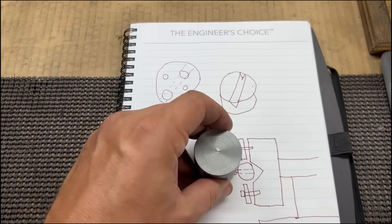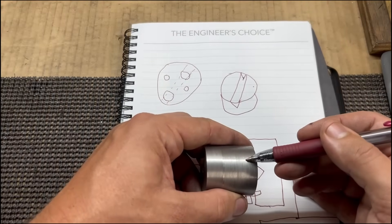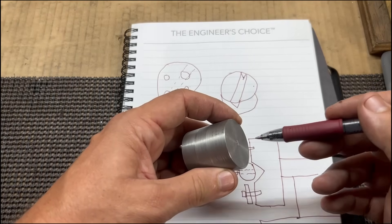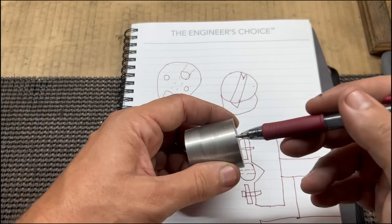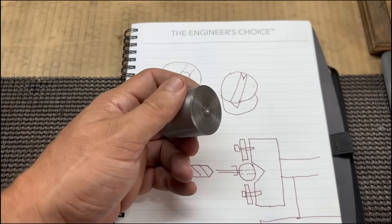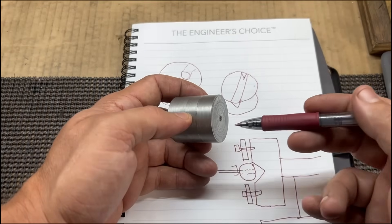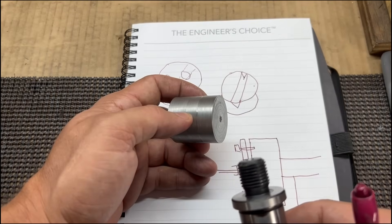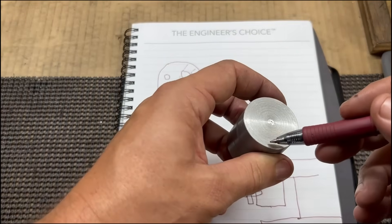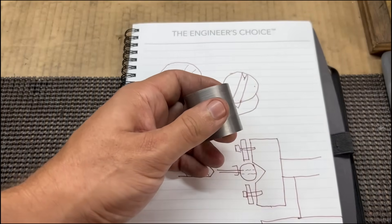This will all make more sense once we get it together. The first thing we're going to do is drill and tap two holes here — that's to bolt this plate back on. Once we get this plate cut off, we'll start working on the back side, get it drilled out, and then cut the threads on the lathe for this arbor. Then we'll screw onto there, cut a V into the top, drill the plate for the thumb screw holes, and make up some thumb screws.